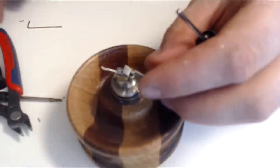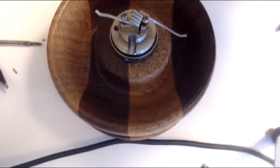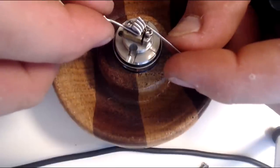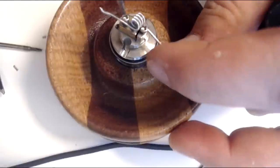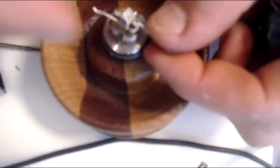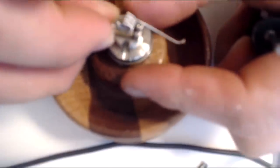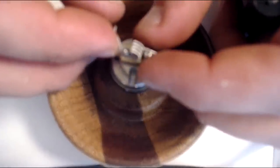So, what you would do, is this will focus better. Just trap the leads right under the screws, but you can see my leads are pretty big, so it's going to be hard to do, but that's exactly what you would do. You would trap it. You would get it under there, and the screw would just grab it. Now, this would be better for round wire, because you could also just hook the round wire in there, and it's not focusing again. You could just put a hook on it. You could go like this, wrap it around and put a hook into it.